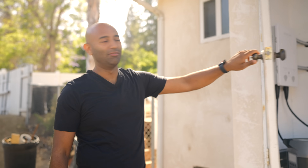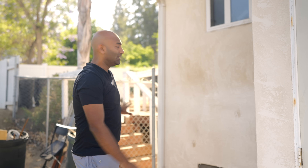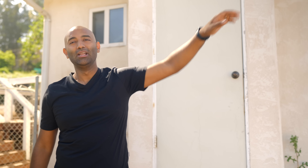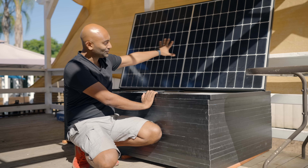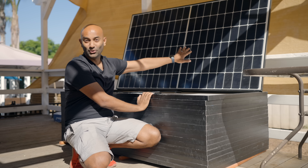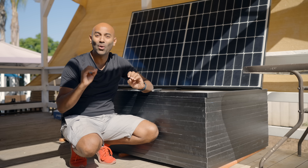Now we've seen how it jumps in in 20 milliseconds when the power goes out and powers your house — this is super awesome, but we're not done yet. This is only part of the puzzle. Up next in a future video — subscribe and stay tuned — we're going to build an entire enclosure out here to house all the batteries. And second, we need to add solar. As cool as this is, currently it's just battery backup or energy arbitrage — charge at cheap times and power your house when it's expensive. But for us, I want to have full solar coverage. The smart home panel doesn't really involve solar, but your batteries can. Each Delta Pro has a 1,600-watt solar input — direct current input from the panels. So in a future episode, we're going to clean up the roof, put the roof racking hardware, install solar, and feed it directly into the batteries. That way, they're charging from the sun all day and powering the house, and we can go completely 100% off-grid.